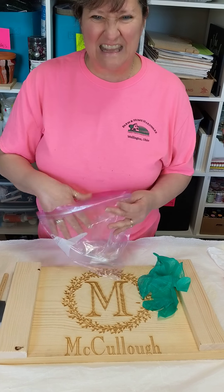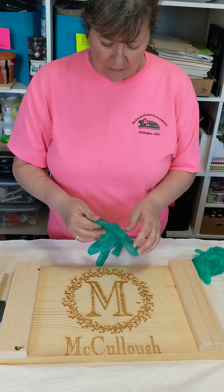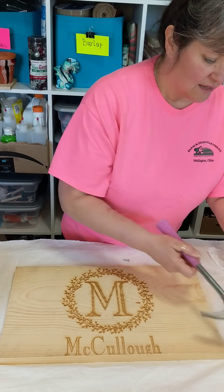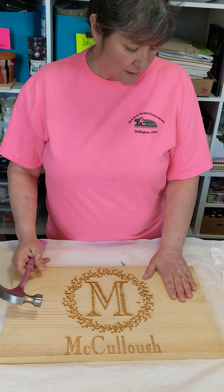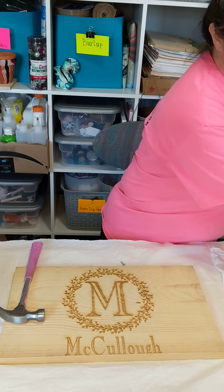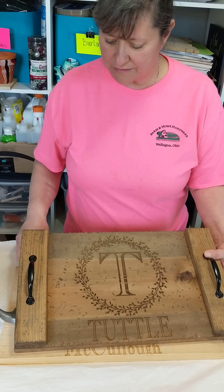For the side parts out of the one-by-threes, we're going to use something called Aged Wood from Varathane — great product. It's not a stain; it's more of a water base, although it is tough to get off your hands and clothes, so I suggest wearing your painter clothes. Gloves are included in the kit. The Varathane Aged Wood Accelerator is fantastic — we're using the brown, but it also comes in a weathered gray and a charred wood which is an awesome black-looking finish. Much less smelly, less chemicals than stain, really fun to work with. You'll also get a foam brush in your kit.